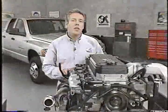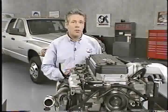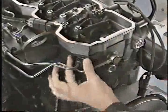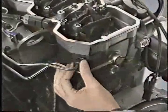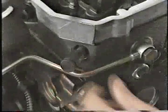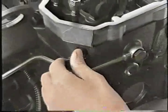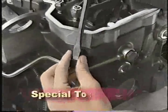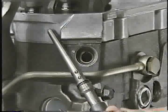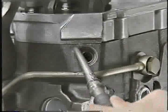There are several items worth noting when it comes to injector service. Be sure to use a backup wrench whenever connecting or disconnecting a high-pressure line from a high-pressure connector tube. Also, be aware that there is a new tool used to remove the connector tubes, number 9015. These connector tubes are directional, and on reassembly, the locating balls on the tubes must engage grooves in the cylinder head.